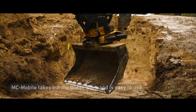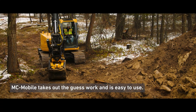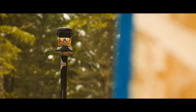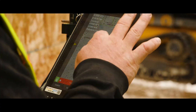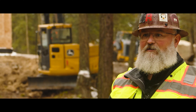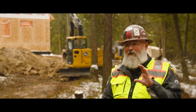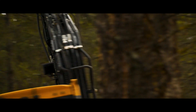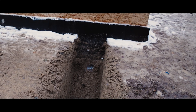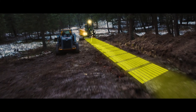You get in the machine for MC Mobile — now the machine is your rover pole. Mac is digging the sewer outlet to the septic system. We knew his chase was on top of the footing. We set our prism pole on top of the wall, did a four-foot vertical offset, and then we knew the slope we needed to the tank, so we put that two percent slope into the inlet into the septic system. From there we knew the measurements to the bottom of the tank, so we put that surface there. We knew the elevation of the outlet. From the tank to the field lines we're about to dig, he's just going to dig to that polyline. It'll be perfect.